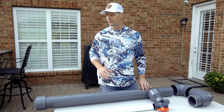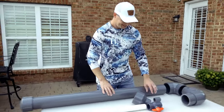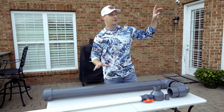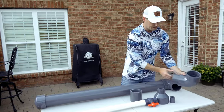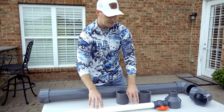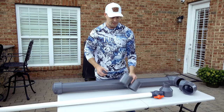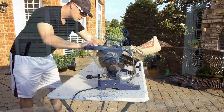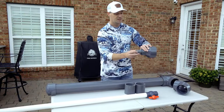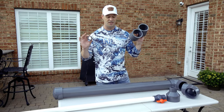I'm confident this thing is going to shoot farther than any we've made before, and I cannot wait to see it happen. I've gone ahead and cut all of the parts to help the video move along. We've got a five-foot piece of Schedule 40 PVC for the barrel — it can be Schedule 40 because it's not going to be pressurized the same way. For the Schedule 80, I only needed two pieces at four and three-eighths inches to connect the elbow bends, and about a two-and-a-half inch piece to connect the step-down into the ball valve on the pressurized side. You cut out three pieces of PVC and you're ready to glue the thing together.